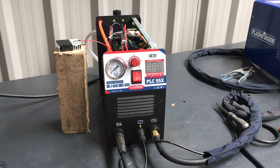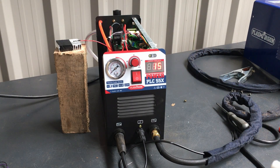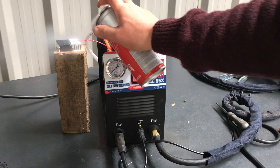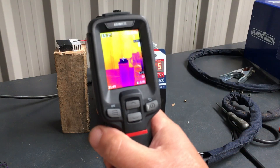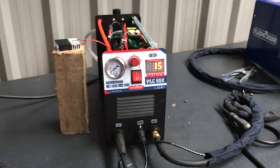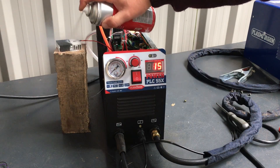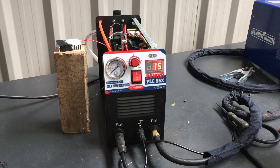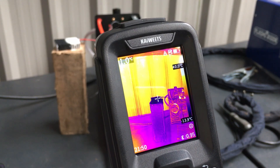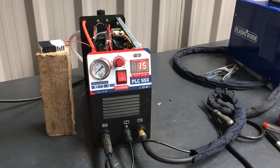So what I'm going to do is just plug this in, switch it on, and then the first thing I'm going to do is use some freezer spray and we'll try cooling this down just to see what happens. Right, let's see what temperature that is now — it's about 14 degrees. Let's see what we've got now — oh, we've got about one degree there.